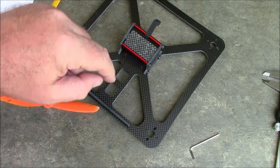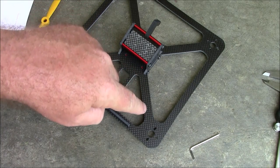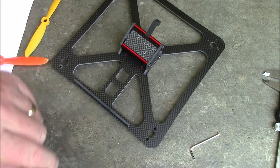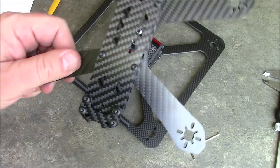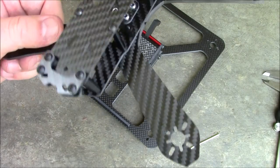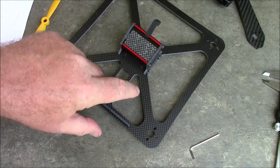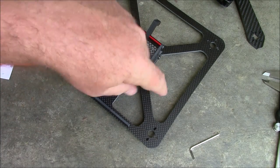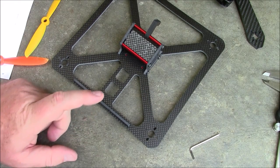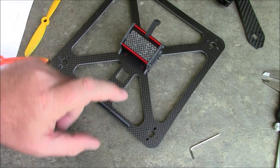This kind of shape is similar to what a few other people have made. The nice thing about these arms is that they can stay skinny, and by being a little bit thinner the air can get past them a lot better than something like the RD-210 where the arms are thicker. All the carbon fiber underneath the propellers is just slowing the wind down getting past there, which can lower your thrust. Having smaller arms like this makes sense - they would be a little bit less intrusive to the wind pushing past them.